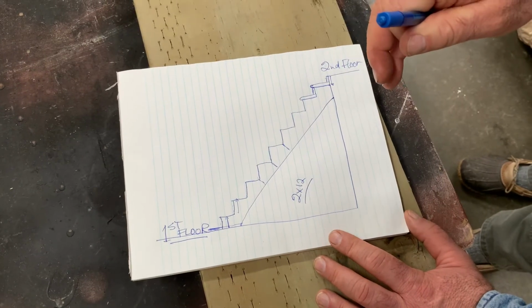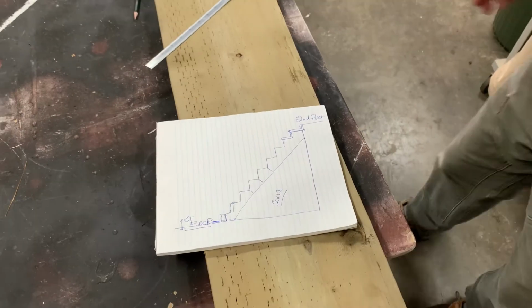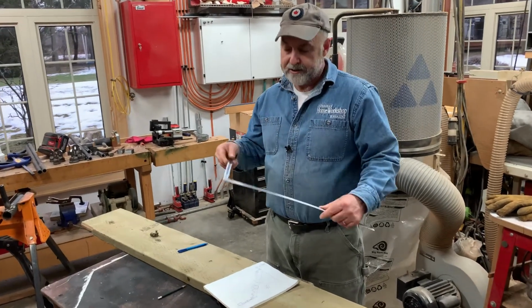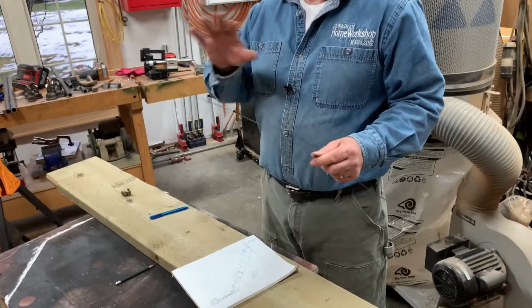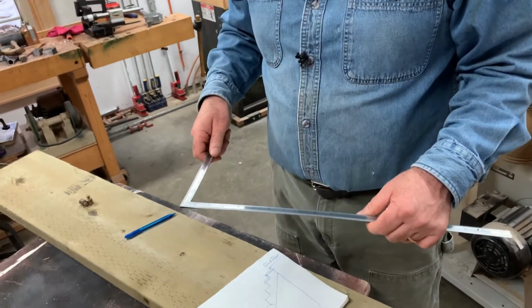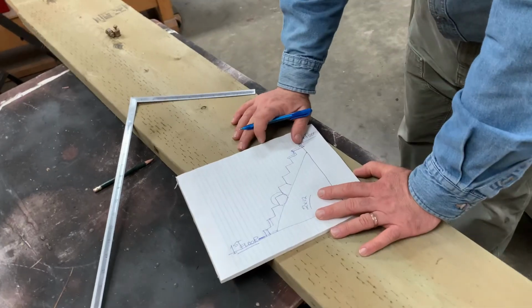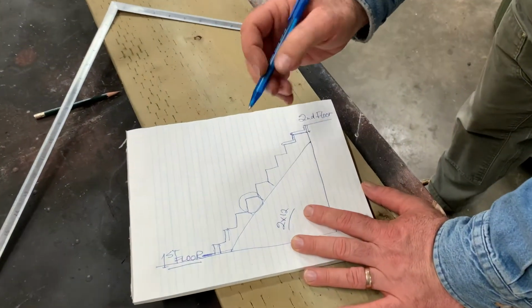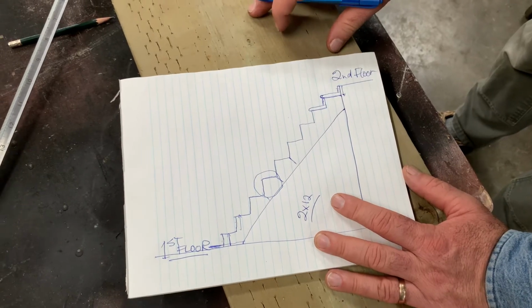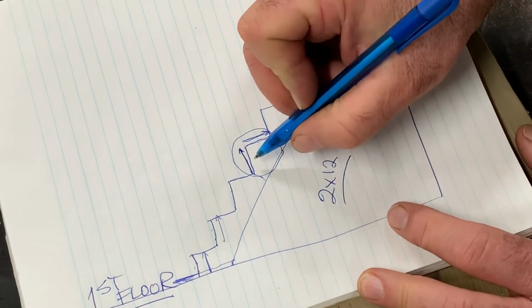But before we get there, now it's time to use the carpenter's square to mark out those notches with precision. So this is the square that I'm going to be using to lay out the stringers. It's not a conventional carpenter's square, but it's going to work just as fine. It's the numbers that count, not the thickness of the blade. Now, my job at this stage, your job at this stage actually, is to mark accurate and consistent rise and run figures on your wood. There's a little formula here that you might find useful.